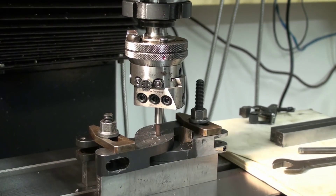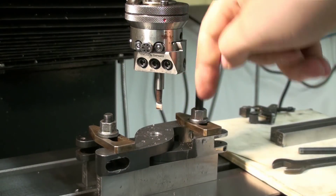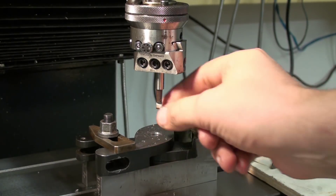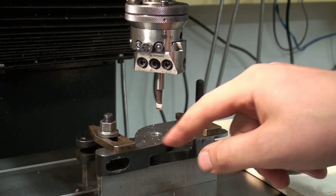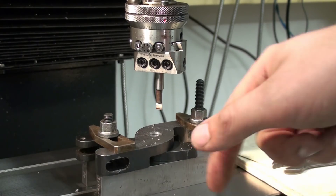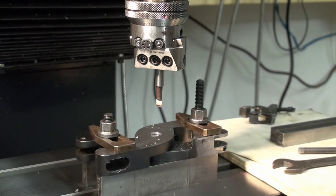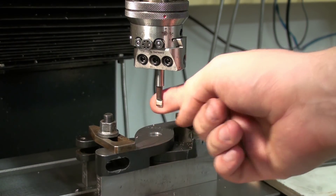Turn the spindle off. I always turn the spindle off and retract the tool while it's still standing because I don't want spiral grooves on the retract from re-cutting of the tool. The tool flexes a little bit during the boring process, and when you return it, it makes a kind of spring pass. The spring pass with a quick retract looks like a super steep thread, and I don't like that. That's the reason why I pull the tool back without rotation.